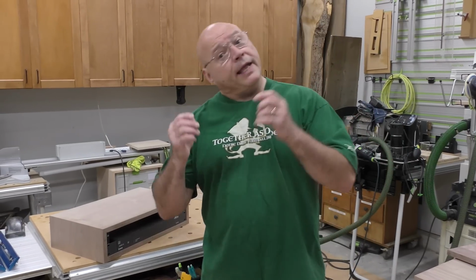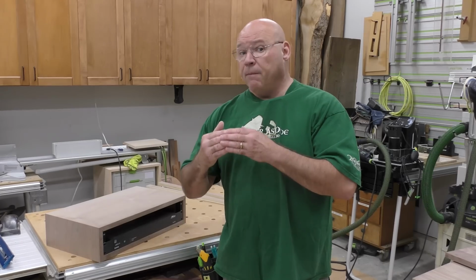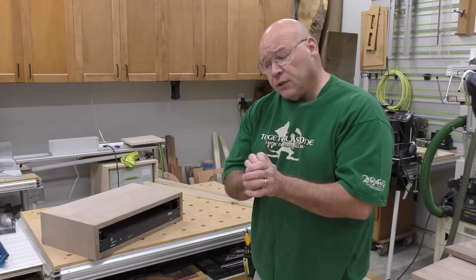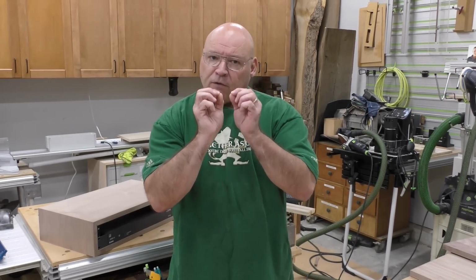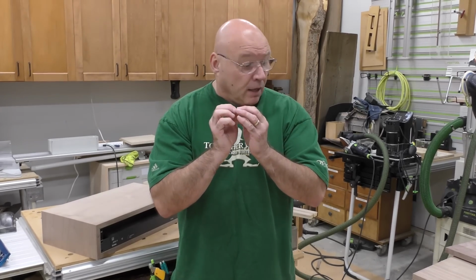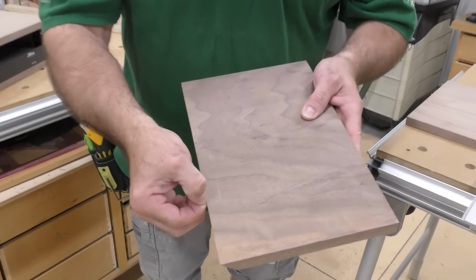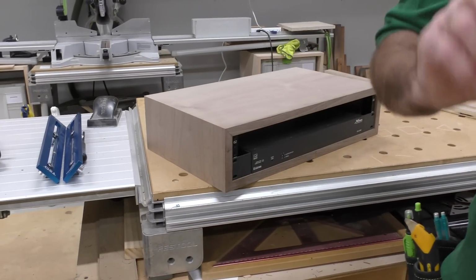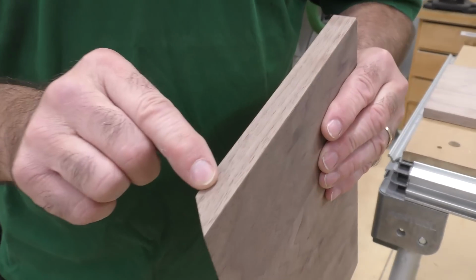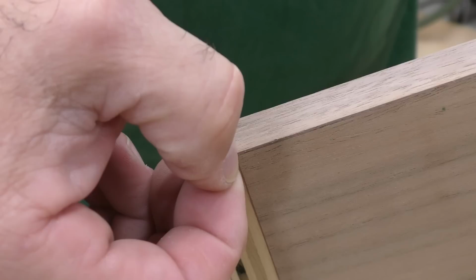And then you can go and tighten these two screws. So we got our rips done, we've got our edge banding done, we've got our trimming done. Now comes cross-cutting the bevel. And that's really tough to do sometimes. To make a perfect beveled box, you want to eliminate tear out. You want to make sure that long point is crisp with zero tear out, so you have a perfect match here. But more important, right here, okay? That edge banding, forward and aft, there should be no tear out, and there isn't.